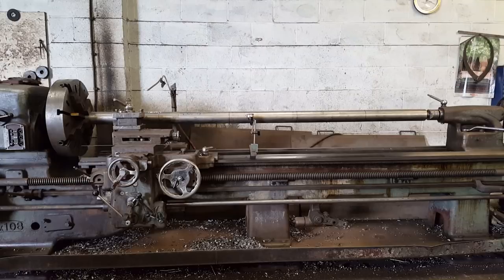I'm not allowed to use a steady rest, chains, cutting oil or magnet. But how you could use a magnet on titanium is a bit confusing. This is a DSG Type 21 lathe, which has a 94mm throat, so I'll do it in stages, feeding it down. There is no chance to do this full length without a steady rest.